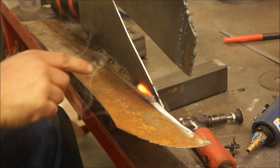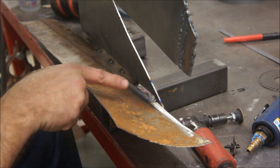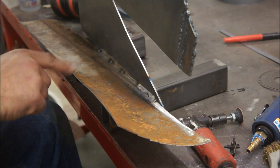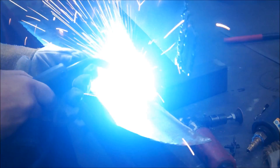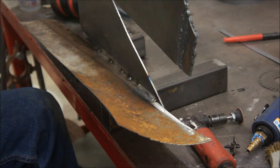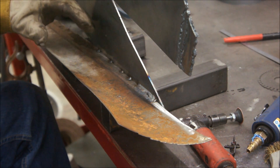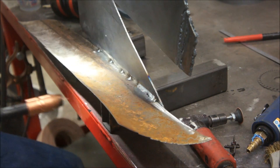Alright, so I needed to stay up higher on the thick steel longer. I came down low and dwelled just a little bit too long and it ate away right there. No big deal — I'm kind of figuring this out. I can fill that back in, no problem. Maybe also I might want to put a tack in between that two and a half inches — about right in here — and then go that shorter distance continuously and see what happens. That's still going to be pretty hot, so I'll jump over to another area. I think I'm going to try to stay up higher a little bit longer, and then come down — I was doing real good until I just dwelled a little too long.